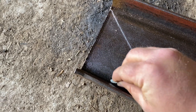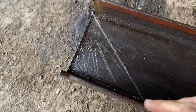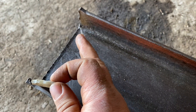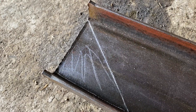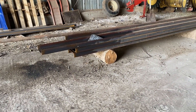I'm going to cut right along here, leaving this piece and cutting out all this stuff right there. Once I get that cut out, I'm going to use a torch and heat up about right here, then use a hammer and hopefully bend this piece up and weld that in place. That'll give us a nice little running skid. Don came over here to supervise. Today we're using the Hypertherm PowerMax 45 plasma cutter — that's what we're going to use to make all our cuts with.